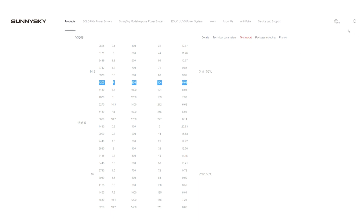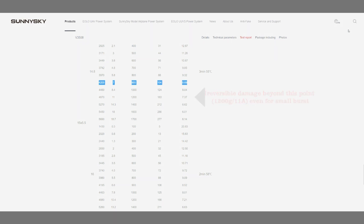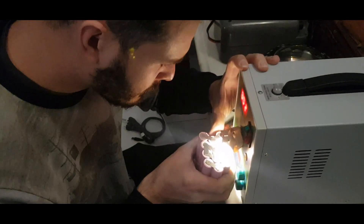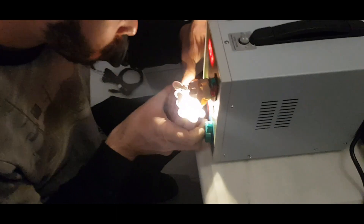Unfortunately, even with the bigger battery bursting at 40A, we cannot go full throttle on these motors. However, my autopilot is programmed to never request full throttle within the flight envelope. So, all things considered, I am proceeding to make my custom 10,000mAh battery and will show you how in the next video of this series.